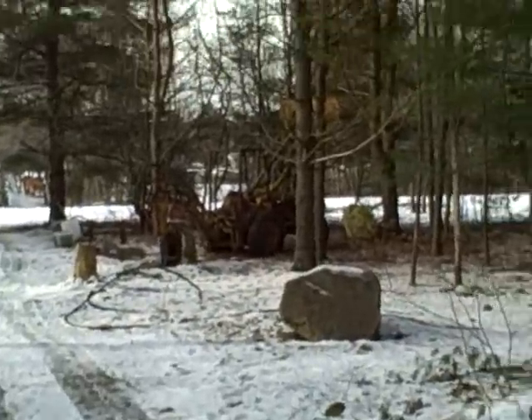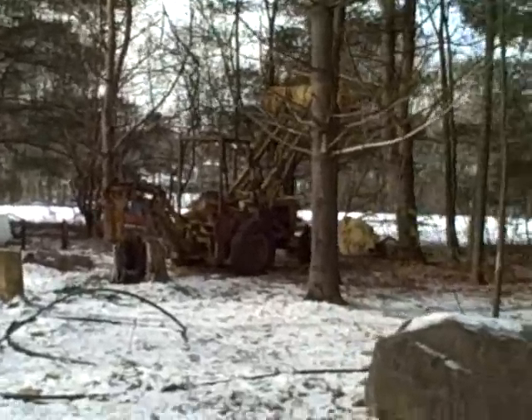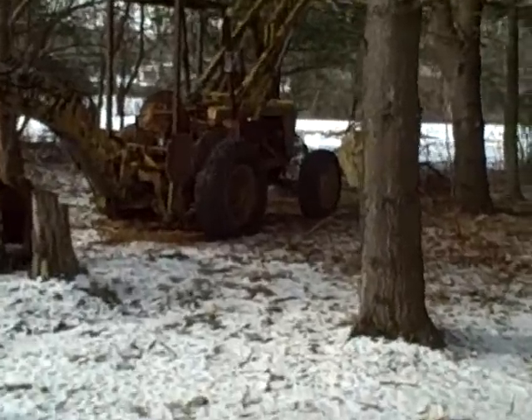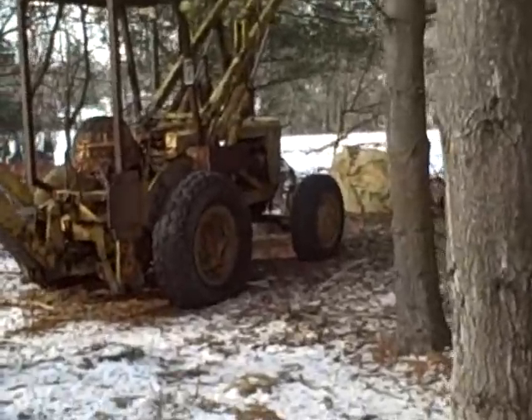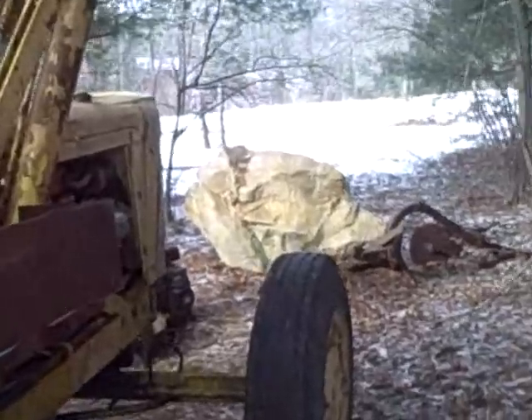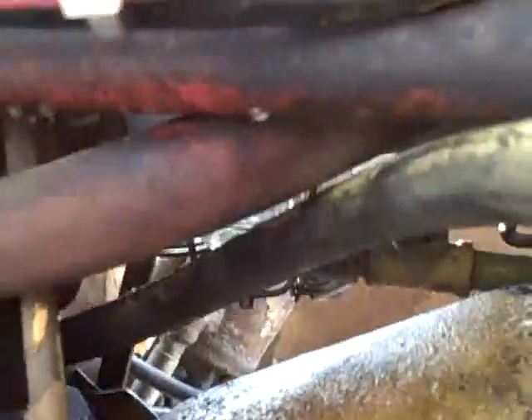It's mid-morning, around 10 o'clock the next day. Let's go over and see how things worked out overnight — if we got any leaks. What this is going to tell me is if I see any drips on that sediment bowl assembly, it would mean that either my connection where it screws into the bottom of the tank is leaking, or the valve assembly is leaking. I'm pleased to see there is no sign of leakage whatsoever.